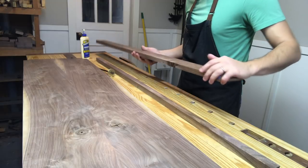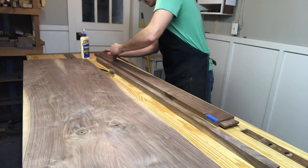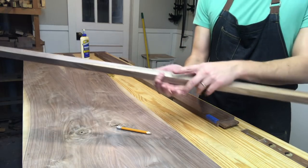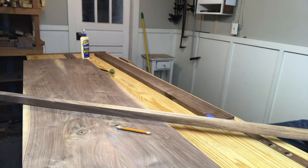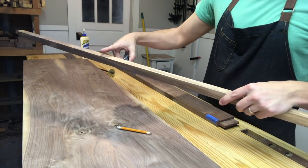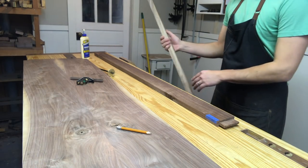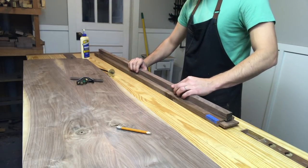There we go — much clearer. I'm going to come back and darken it with a pencil. I've marked my out face and my top face, which is the flattest, squarest face. What's critical is that from the top to the part that's going to be glued, it has to be square. This is the part that's going to be glued to the back, and it's square along its length. Because if it's tilted out, that'll cause the shelf support to be tilted one way or the other. So it's going to go right onto here, glued on that line.